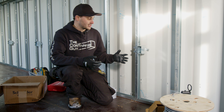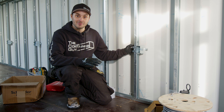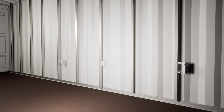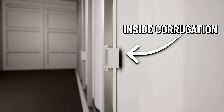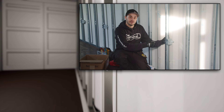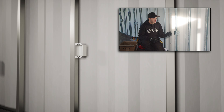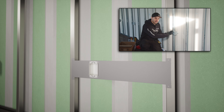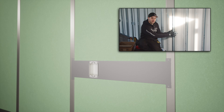I just came in here and the electricians are hard at work. I stopped production because this electrical box is pretty much right up against the inside corrugation. It wasn't part of the customer communication, but I would have suggested every 44 inches we do a plug — because then we can put the plug where the outside corrugation is and get a full two inches of foam all the way around the box.